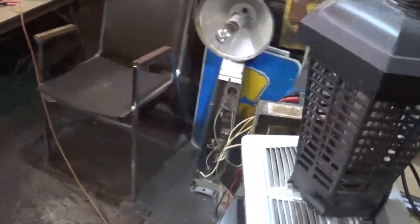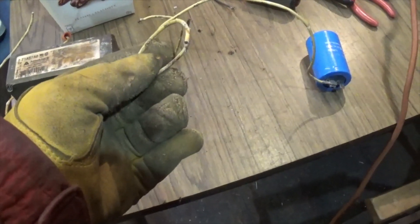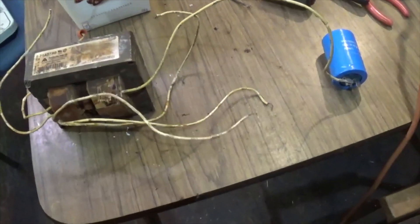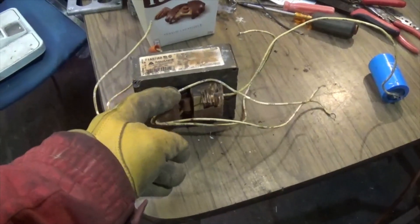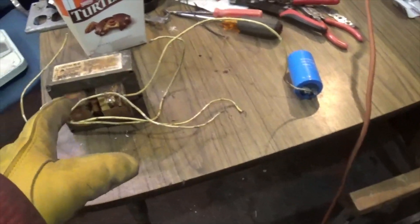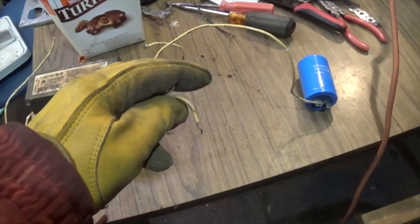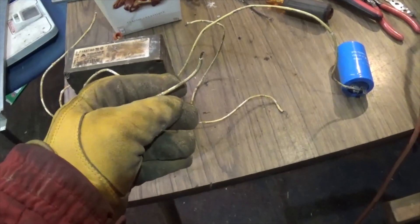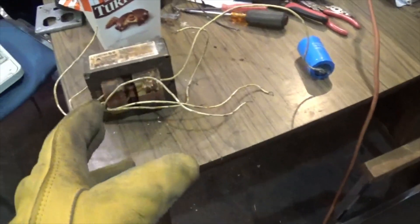I've got a little hunch - when I was wiring the other ballast, maybe it's important to separate the common coming out of the bulb from the rest of the stuff that common is hooked up to. I was sure they just hook up together right underneath the winding, but I can't help wondering if that's causing the humming. This new one I hooked up with all the commons bunched together; on the ballast in the light I separated the lamp common from everything else. Let's test that on the table.